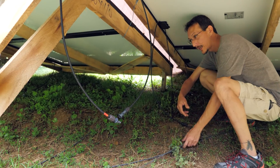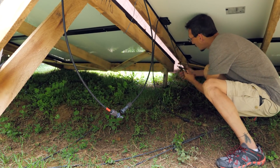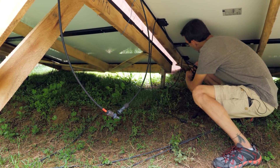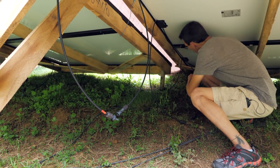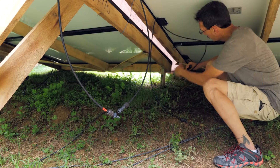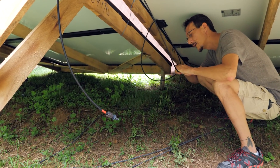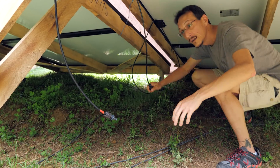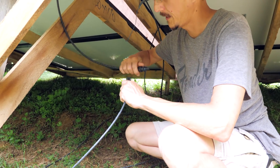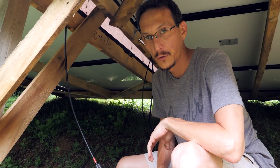I've made my cables from the combiner box to each string and they're just sitting here; I'm going to plug those in now. So I've got PV1 String 2 going to PV1 String 2. The positive of this first panel goes to the negative of the second panel, the positive of the second panel goes to the negative of the third panel, and then the positive of this one goes back through to the combiner box using the cable that I made. Now this string is live, so we'll go put a voltmeter on it and see what it looks like.